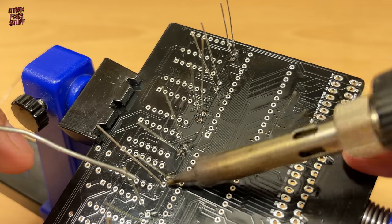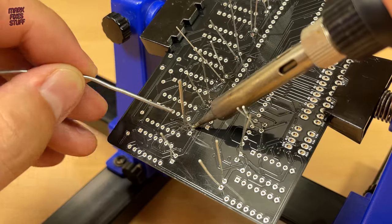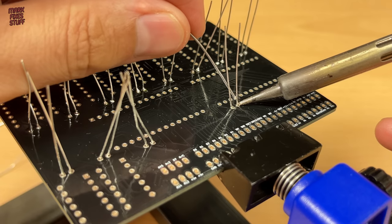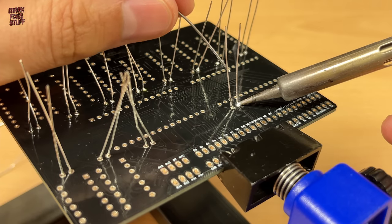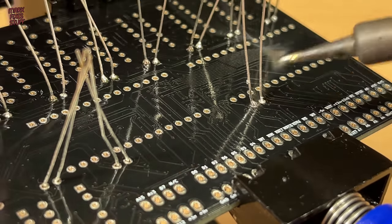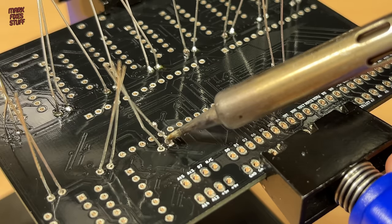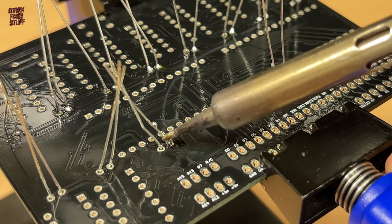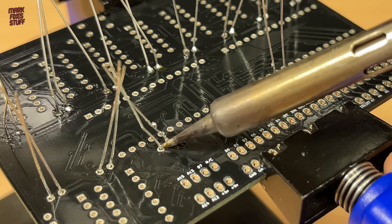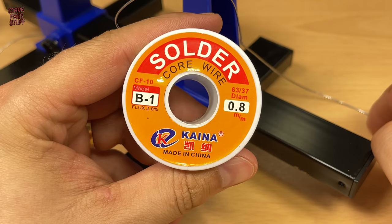The radio lot works great, so I know that it's not the components or the board. So with my eye in, I decide to try the new solder again. It's meant to be a 63/37 alloy with a rosin flux core, but in reality it's an awful clumpy mess. Even additional flux doesn't help. Don't buy this solder, it's rubbish.